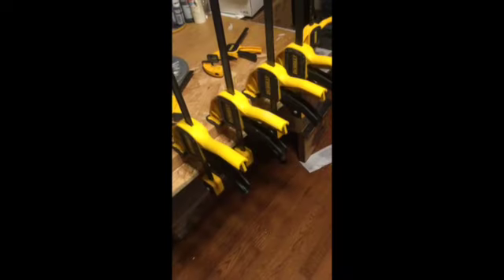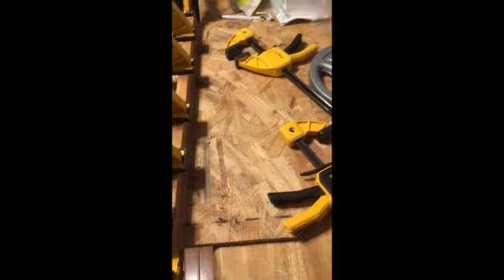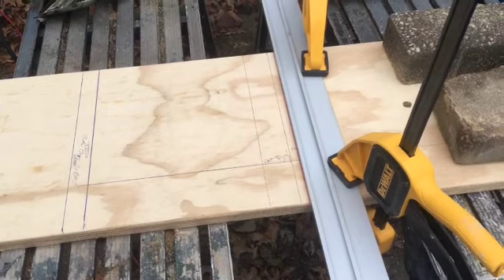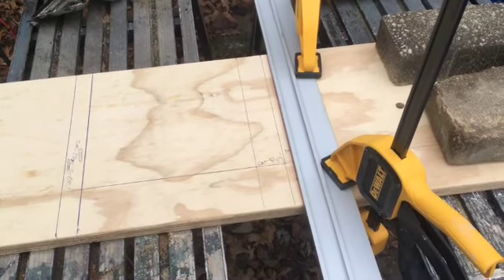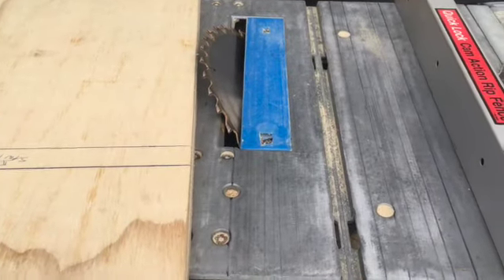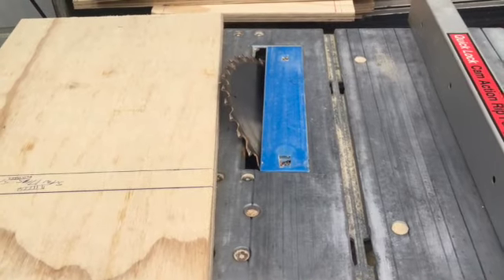I clamped them together so they'd be exactly the same. Now I'm gluing on the brace for the baffle onto the side — I'll do one and then the other because I don't have enough clamps. Then I'll cut and do the two sides that are going to be straight boards. I'm cutting the other two side panels, with the table saw set up to cut a 45-degree angle to match the edge of the sides up with the back.